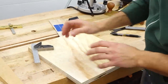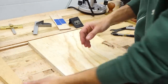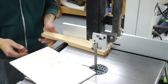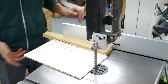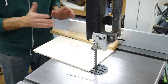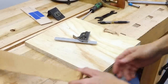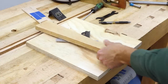Now we'll get into actually making the jig. I have a piece of plywood here — you can use literally whatever you want. The only thing to talk about is the overall length of the jig, which is going to vary depending on the size of your bandsaw. This one here is about 13 inches long, and that allows enough length behind the fence to grab the jig as you're working. You want to have this thing set up so you can actually grab the jig while your fence is completely out of the way. So depending on how far the front of your fence is from the front of your blade, that'll kind of dictate how long this thing has to be. On this end, I like to have a little bit of meat here so there is something to actually grab onto.